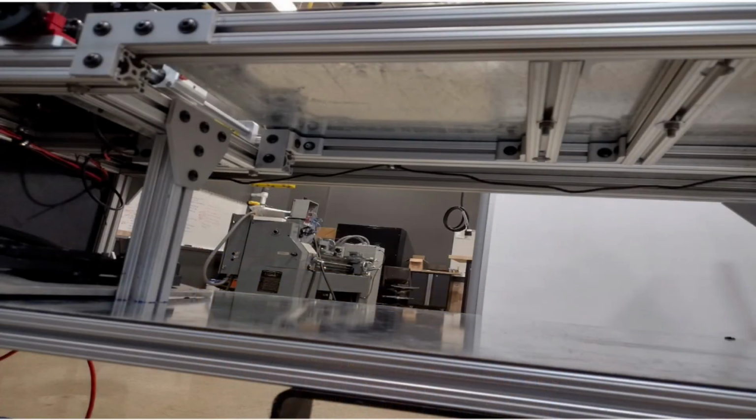One of the biggest issues the team had was running the gauge R&R. The first test yielded greater than 10% GRR. The main reason for that was the warping in the table from both the linear slide table and the rotary table. To combat this, additional supports were added to stiffen up the table and eliminate this problem.